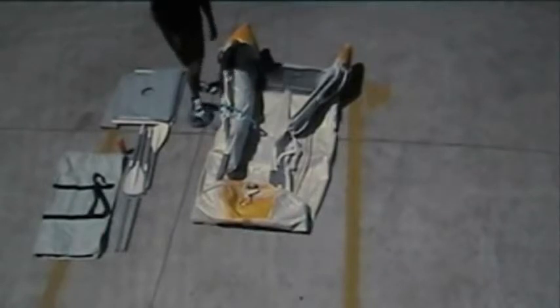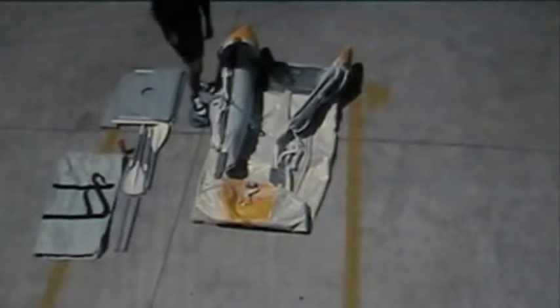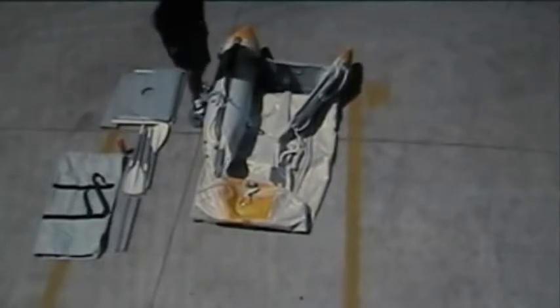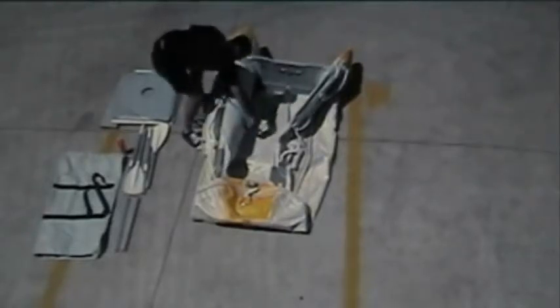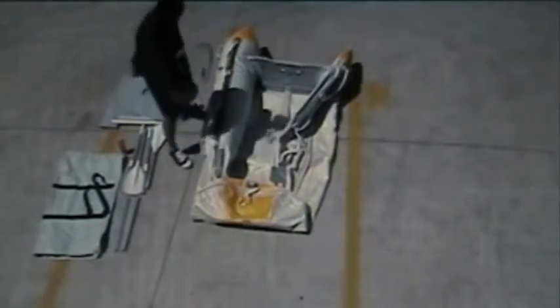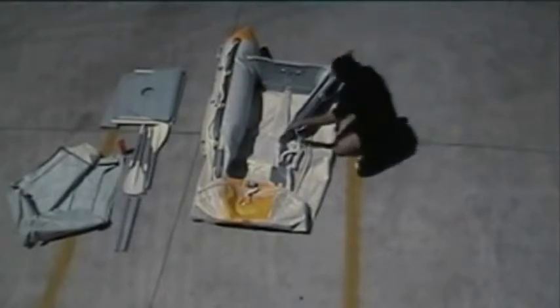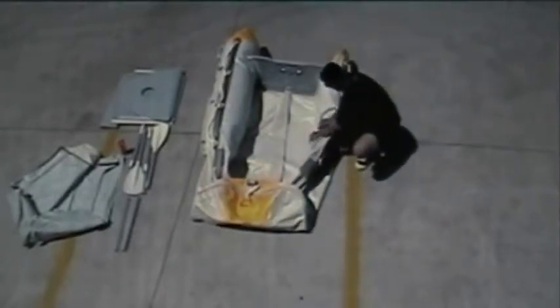At this first stage, we only inflate the boat partially. We don't attempt to get it fully inflated because it's really just to get it into shape, ready to fit the floorboards in. All chambers have a valve which has two positions. One is a free flow position, and the other one is a one-way mode. And the one-way mode, of course, is what we want when we're putting air into it. The free-flow mode allows you to empty the chambers when you're packing it up after you've finished using it.